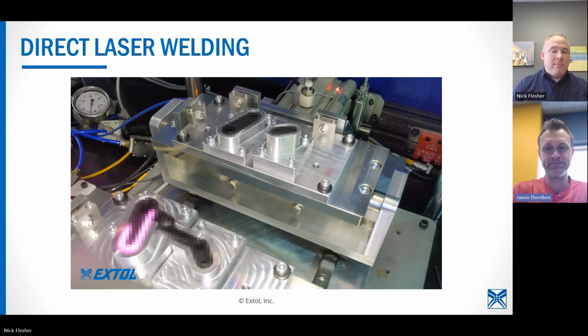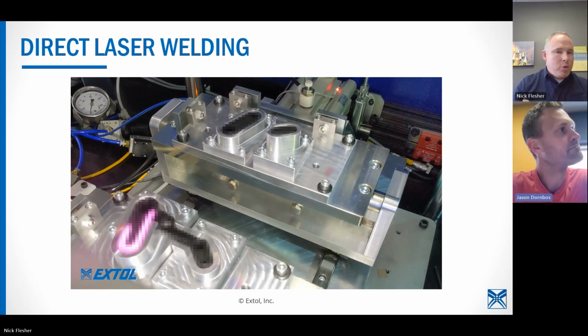They designed it for ultrasonic, and then the ultrasonic suppliers said you can't do these parts because of what's called far field welding. I'm not going to go into that, but essentially they were stuck. It was nylon. You can't really do hot plate welding, vibration, too much particulate. And so this is a really clean nylon weld.